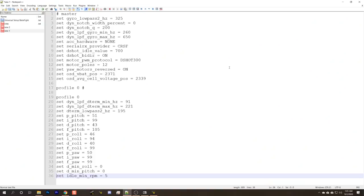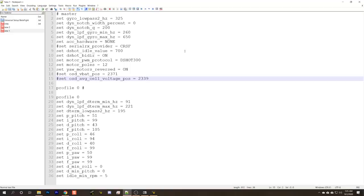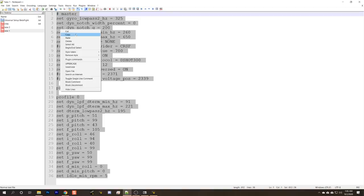And I'll put this down in the video description too. Fortunately, it's not my first time. So some of this stuff, actually, I can see doesn't apply to this exact build that I've done, and I'm gonna comment it out. Let me show you what I mean by that. Serial RX provider equals Crossfire. Well, if I was using Crossfire, that would be true. But I'm not. So I'm gonna put a hash mark in front of that line, which will comment it out. And here they're messing with the OSD, but I've got the OSD set how I like it. So I'm going to put a hash mark in front of that line and comment it out. Everything else can stay.